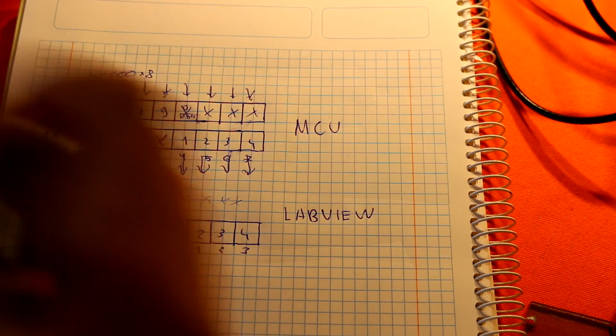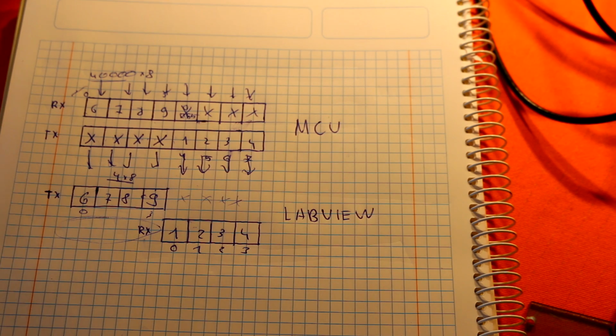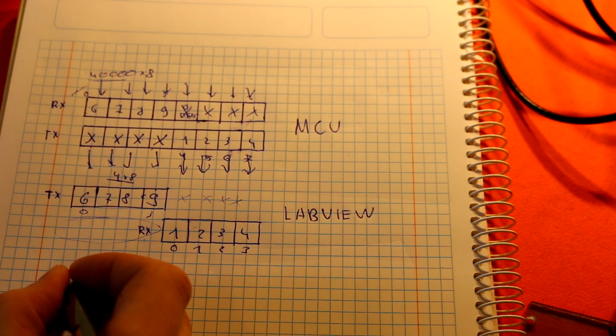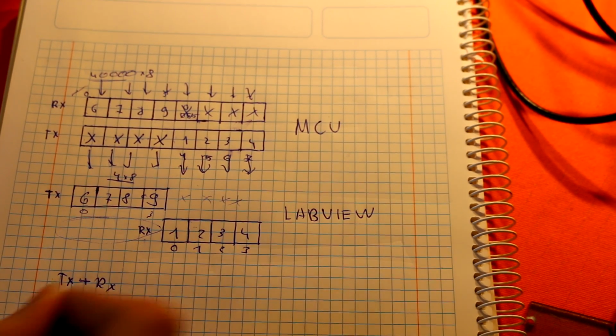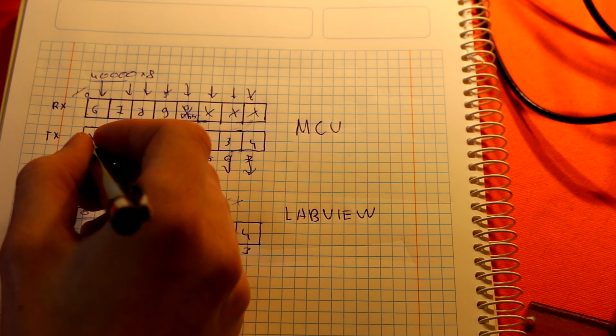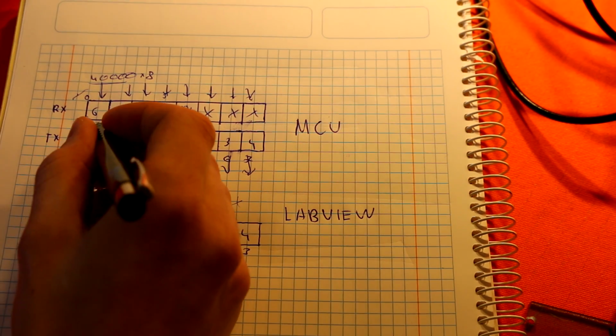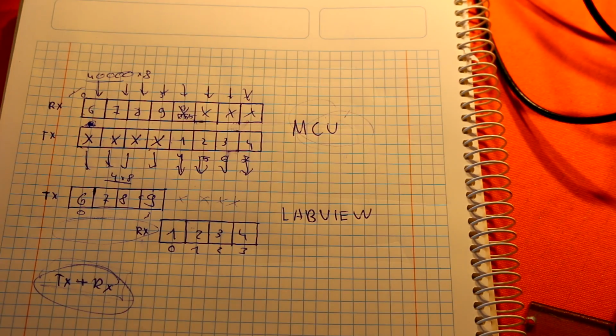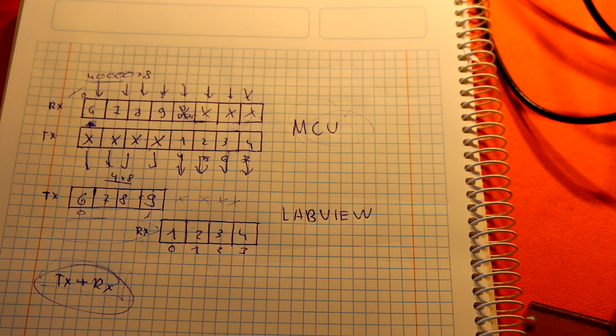Okay, so the SPI DMA controller will be configured in circular mode, and it will have to read how many packets we transmit, and how many packets we will receive. And if we set this number to the correct one, when we finish our read-write cycle, the DMA controller will jump to the first one, and it can read and read and read, and we don't need the MCU to do any work. I mean, this can be static, and the microprocessor can do some calculation, can do some painting to the screen, or do some complex calculation. It doesn't need to manage all of this if it's in circular mode.